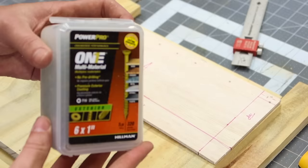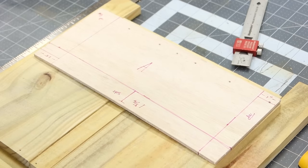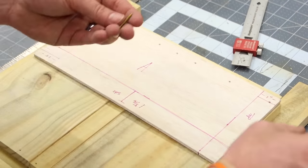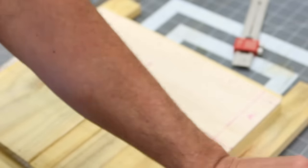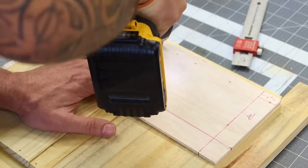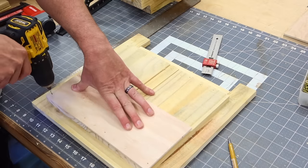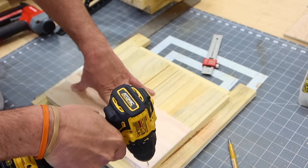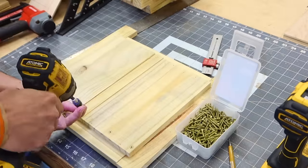Now for the screw installation: I'm measuring up one half of an inch and drawing a line to make my marks for the best screw placement to hold everything together. On my jig I've already done this step, so it would not be necessary if you were using the jig. I'm using one inch coated deck screws for this project — if you cannot find these, you can also use one inch galvanized screws. For pre-drilling, I'm measuring out my drill bit depth and using this jig as a drill guide. Since the bottom wall spacing is the exact same as the top, I can just flip the jig over and use the same holes. Now let's get these screws installed.